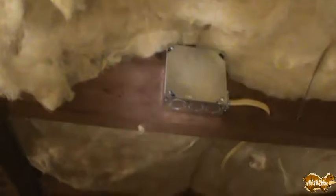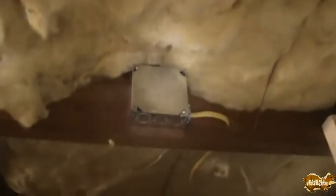Let's get the light on. There's a junction box there. Got Conduit coming down to the outlet and then up above the rafters where Romex is okay. While I was at it, I went ahead and ran a line into this junction box right here. This is a new junction box and there's nothing coming out of it — the wires are just simply capped off. That's for future expansion.